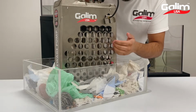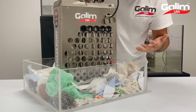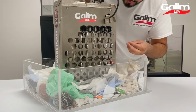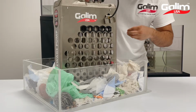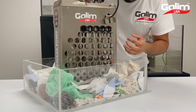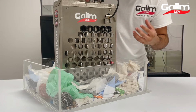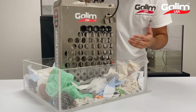So our whole goal with these drilling holes is to give the pump more suction capability. Why? Because if there are any solids that want to clog or obstruct one drilling hole, there are a lot of other options for the pump to keep on working normally. And our pump actually needs only 3 open drilling holes to have the same flow of water as if it was the bottom suction area of the pump itself.